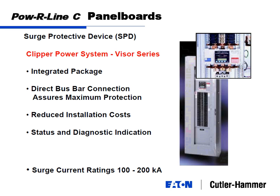Pass that around. So we'll just disconnect that tail if it goes right on the... You mean if we're mounted this way right on the bus? That's a good question, actually, because we have a couple of different ways we do it. Normally, we'll mount it right on the bus. The only disconnect will be the main breaker in the panel or the upstream breaker if you've got a main lug only. So if there was a failure for some reason and you needed to replace it, you would have to shut down the panel to take it out and put a new one in.